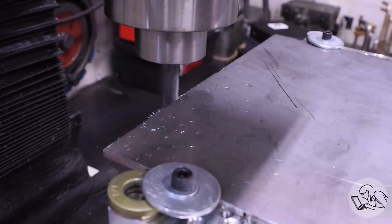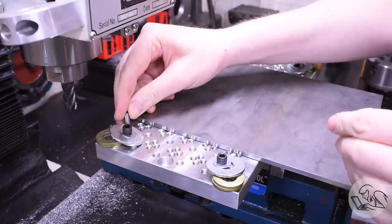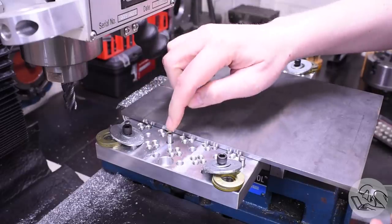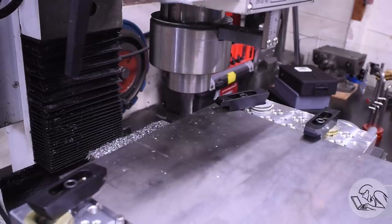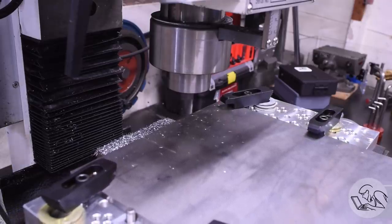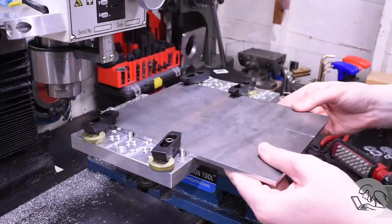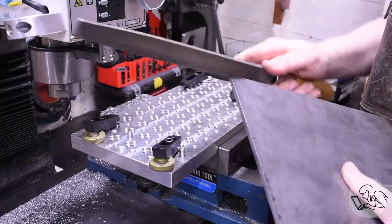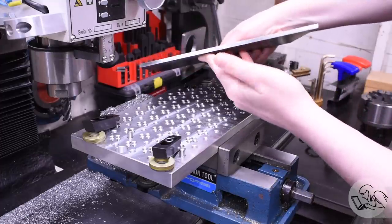With a little bit of practice you can get this in one pass — you can actually dial in a vise or a large piece of stock like this in about five seconds. It's a pretty great technique. You can see there I'm within a few tenths all the way down now, and now I can mill the backside parallel. The only way I can do these cuts on a piece this big is on the back of the X-axis — it's the only place I have to travel. For the short sides I'm turning it 90 degrees and using the pins that come with this fixture plate, referencing the machined edge so we get a good clean 90. The fixture plate is referenced to the vise and the vise is referenced to the machine, so I can use these pins and know with confidence that we'll get a good 90.